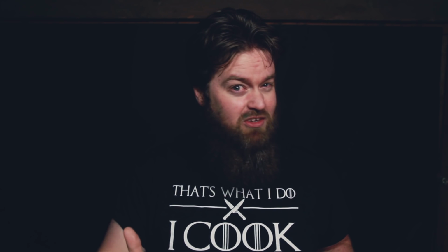With any new skill like this, I find it really important to ask for advice, of course, but also to try and kind of self-assess and critique yourself. Honestly, videoing this process has been really interesting, so I'm really looking forward to sitting down and actually editing this. I think it's going to be really helpful. These are the points that I've come up with so far for self-critique. First, I think that I was not using enough heat, and I wasn't letting the heat draw the braze where it needed to go. I was trying to kind of paint it on, almost like a paintbrush with the braze rod itself. I also think that I was putting way too much braze on in certain places.